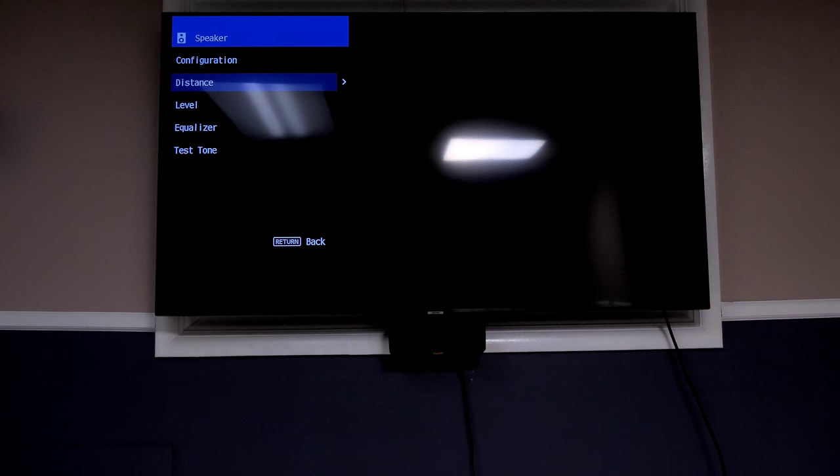So you can see on the screen, most of our values are above zero. And if you watch my channel a lot, you know that we don't really want them above zero, because when you set your volume knob to zero, that's reference level. And when you set your gains, which is what a level is, when you start to get into the positives, you start to introduce clipping into the system.